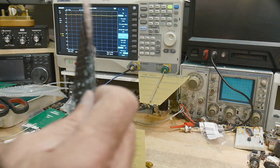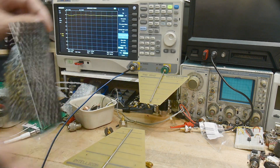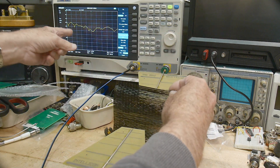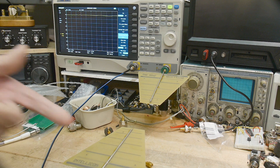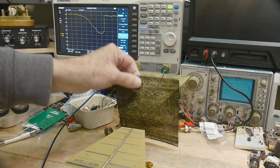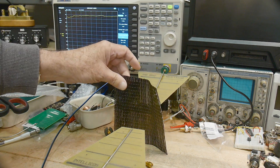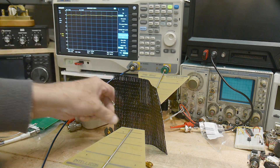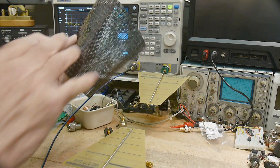He gave me some and I cut out a polarizer the same size as my other polarizers. When I put it in vertically nothing happens, and when I put it in horizontally I get about a 15 dB loss. I have these polarizers over on PCBWay if you want to order them, but they're quite expensive. This carbon fiber was given to me, but it's a great idea — vertically it doesn't attenuate at all, and horizontally it does.